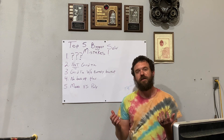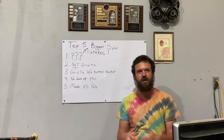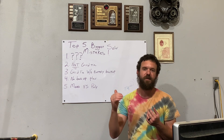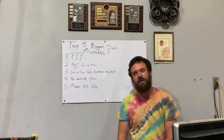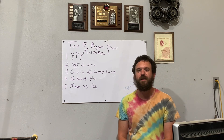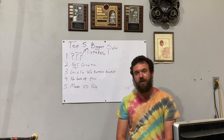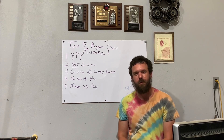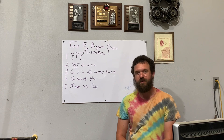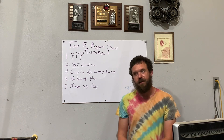My battery bank, when it's 50% charged, can take all the electricity I can put in — all 2,000 watts from my panels. But as my batteries come up to 60%, 70%, 80%, the amount of power you can put into the battery is reduced. Even though you have 2,000 watts of panels on your roof, if your battery is at 90%, maybe you can only put 800 watts in — you may be losing the other 1,200 watts. You can run things like an air conditioner or pump water, but at some point you don't have enough loads to use all the available power. If you are tied to the grid, you get to use 100% of your panel's output all the time, store it in the grid, pull it back later, and get 100% efficiency out of what your panels are capable of producing. You need to think about tying to the grid.